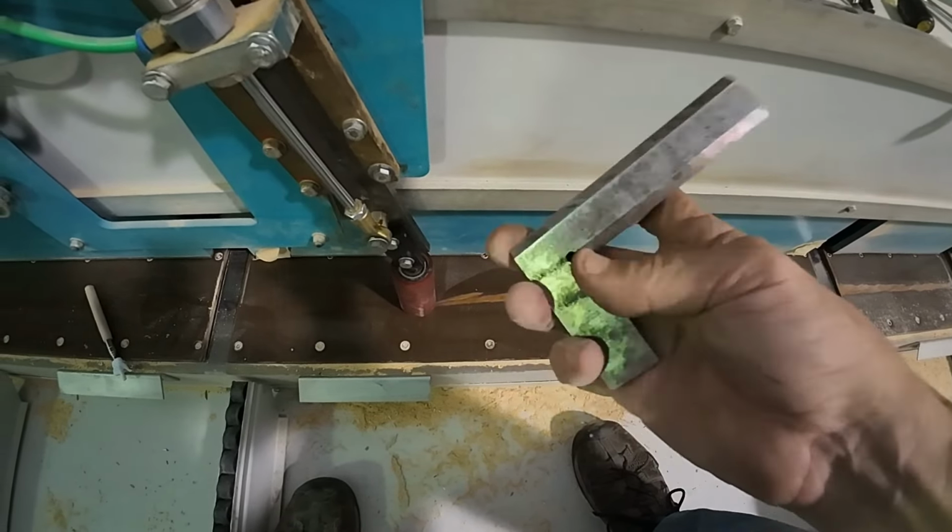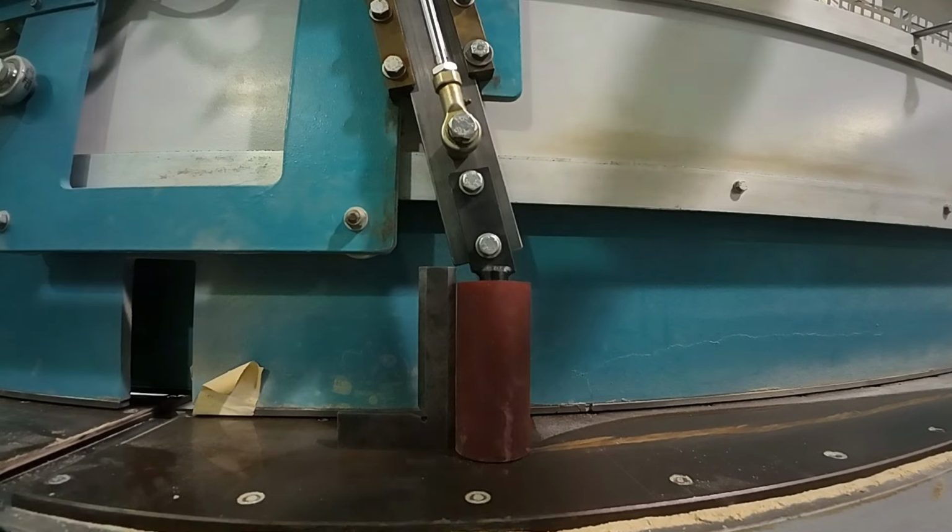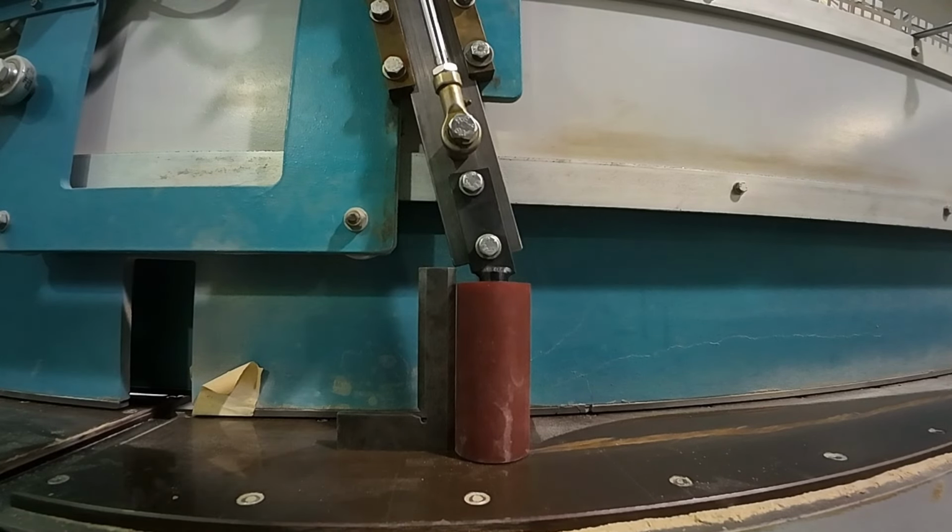And then what that grinding allows us to do is that when we lay it down on the joint, and I may have to do it from the other side because I got the blemishes in the table, when you lay that on there, we bring this up and then it makes a crisp line in here. Now you'll just have to take my word for it, because I can't hold the camera and the flashlight and make adjustments at the same time. But when we shine that in there, you'll see a crack of light. That's why they grind them. It's because that grind causes your crack of light.